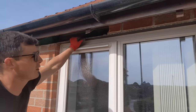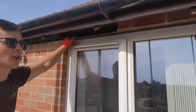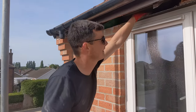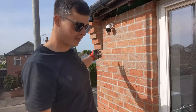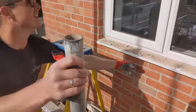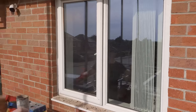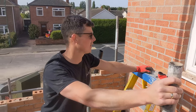First of all, I need to free up this lintel, so I'm going to have to take off all these bricks here. And then I'm going to have to go inside and prop the wall plate a little, because obviously the wall plate is sat on this lintel. Then smooth out and cut down there to form my new window reveal, and then I have another window reveal just there. So I'm going to have to tooth out that brickwork and just make everything pretty. So although it's an easy job, it's going to be a really faffy job.